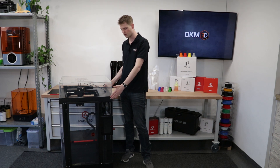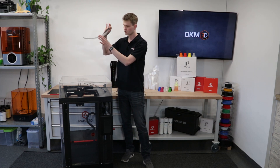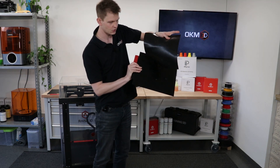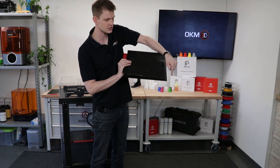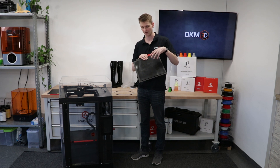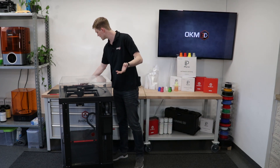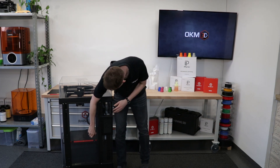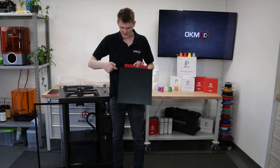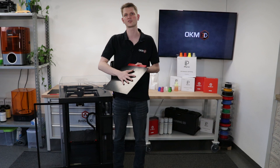Together with PP Print, we've developed a kit that improves the Pro 2 in several ways to make sure you can print properly with polypropylene. Previously, the P surface came in a piece smaller than the actual build plate on the Pro 2, so you would lose some printing space around it. In addition, you would have to glue it down, and with very large polypropylene parts, warping forces could peel the adhesive off the aluminum plate, causing your print to fail. Now we've taken the build plate and got a P surface that perfectly fits the entire size.